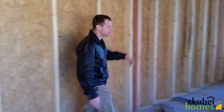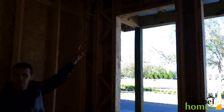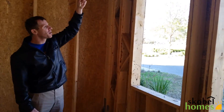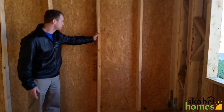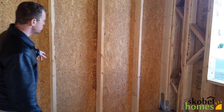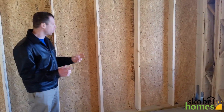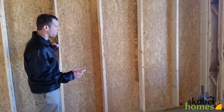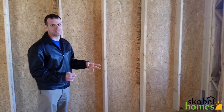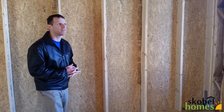As I was trying to explain before, these are the windows. You can see the walls are framed with headers above the window openings — that's to support any weight above that header board. All these pieces of the walls are called studs. How far apart are the studs? When we do the two-by-six, depending on what the engineer requires, different parts of the house could have different spacing. But a standard wall with two-by-six is 24 inches apart, while a standard wall with two-by-four is 16 inches apart. It depends on the weight above it.